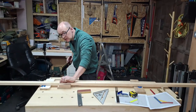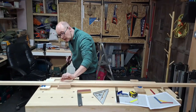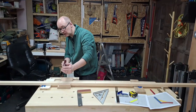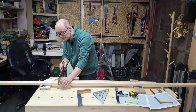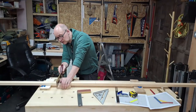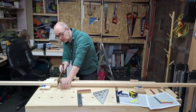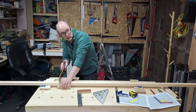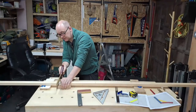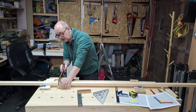Now, the cut that it's making is called a kerf. And we want to keep that kerf out here, and once we've cut across the top of that timber, we're going to eyeball this one and watch that come straight down, keeping the blade plumb. Keeping the plumb is just straight down. So we'll get a close up on this one as we come down.